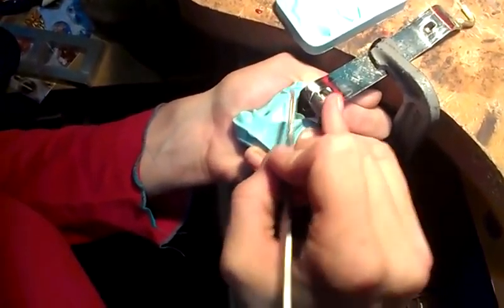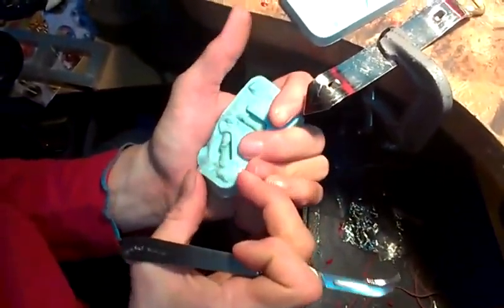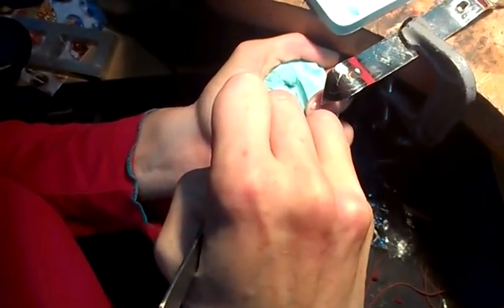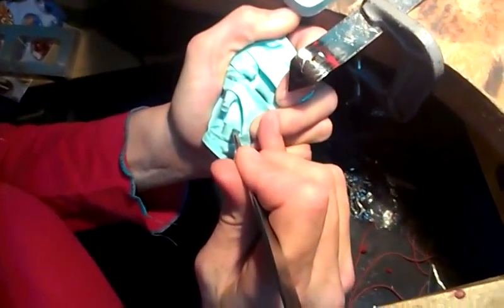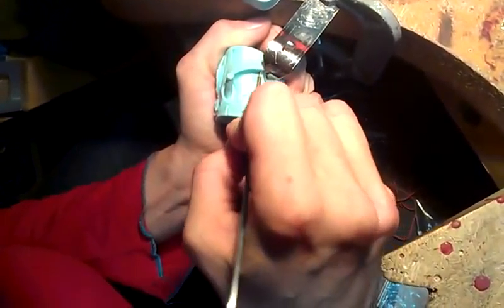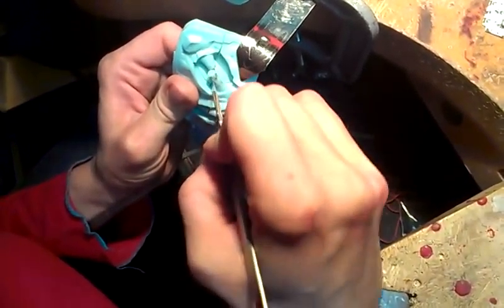You kind of have to account for warpage. This isn't the shape of it. That is like a rectangle, but it's in a wave. So you have to gauge what the material actually translates into in reality. The reason for stretching it is it's actually more accurate. When it's compressed, you have a better chance of cutting it in the wrong place. And so what this does is it ensures your corners come out properly.